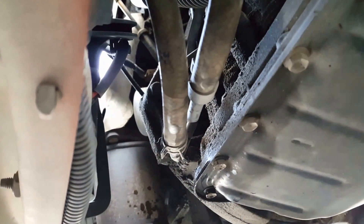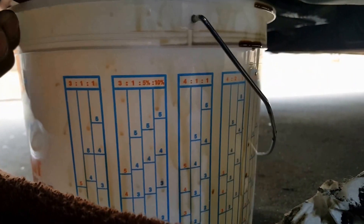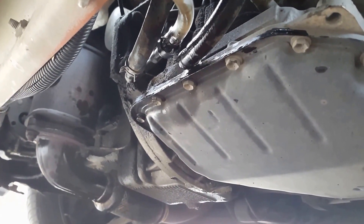Now that I'm under here, you can see I have a little splatter. This top hose is the pressure hose, so I'm gonna take this clip off, slide the hose back, and then add a clear hose to it. Then I'll measure from this bucket.